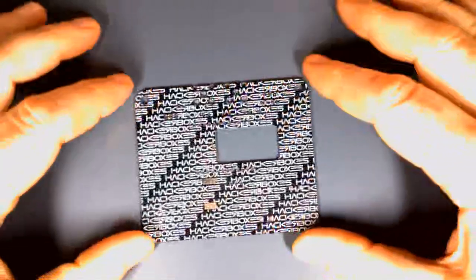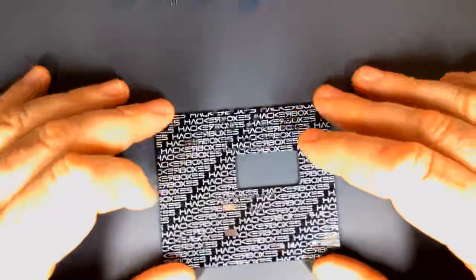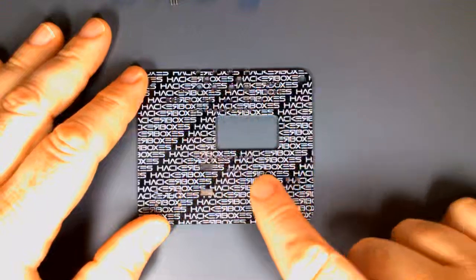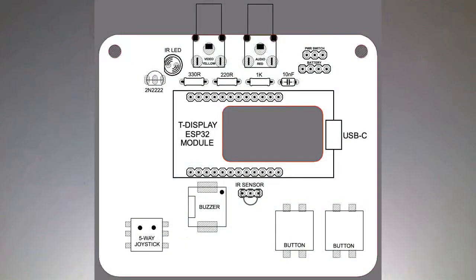Let's check out the actual PCB — this is obviously where we'll be doing our soldering. You can see it has a blacker side and a whiter side. The black side is where we'll be soldering the components. The front of this board uses the silk screen for artwork rather than component labels, which gives it a nicer look but makes it a little harder to build — that's part of the fun. Make sure you go to the box guide and look at the placement diagram, which shows where components go, serving the role that a silk screen label would normally provide.